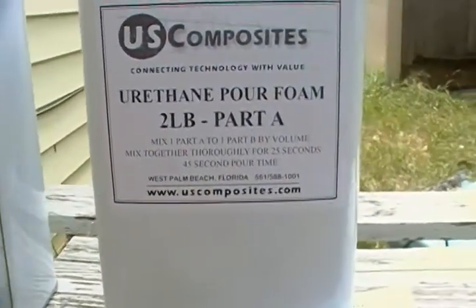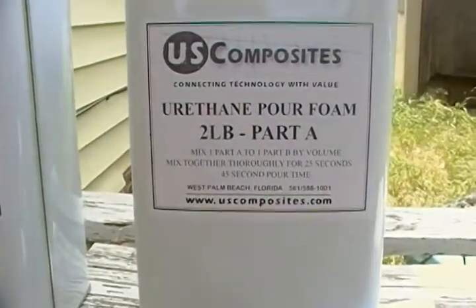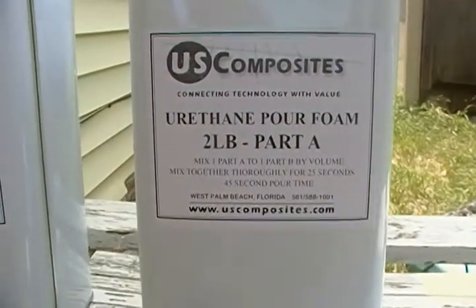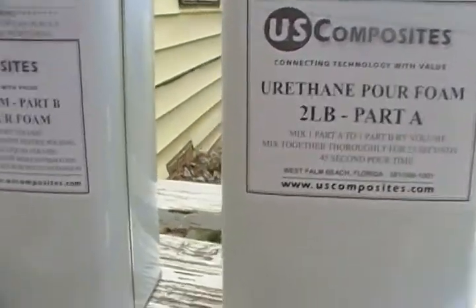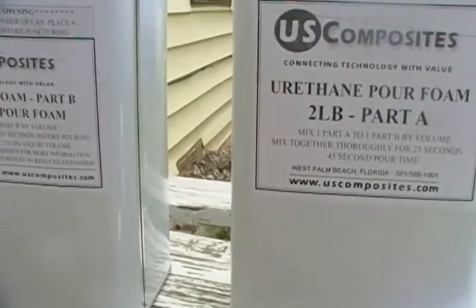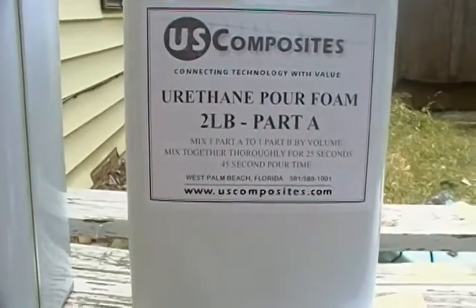This is supposed to give you eight cubic feet per kit. I kind of did the math — I hope I'm pretty close. I got about 17 cubic feet total. I got two kits which would give me 16 cubic feet, so I come short about a cubic foot. I don't think it's going to be that big of a deal — it's more to add buoyancy to the boat itself.